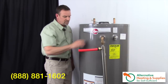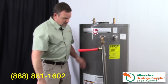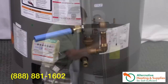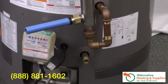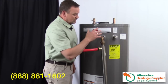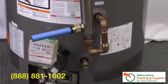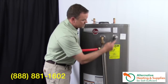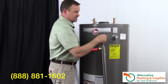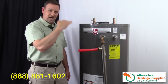You need to install it the correct way. A lot of people don't have side ports on their tanks, but most tanks purchased today always have a pressure relief valve and a drain at the very bottom. This tank does have hot and cold inserts on the side. If you don't have those two ports, you can pull off the drain, put it in like you see here, then take the pressure relief valve, T it off, put a T there — the pressure relief on one side and the top of the side arm on the other side, because it's still going to be flat and the water will rise and go in there.